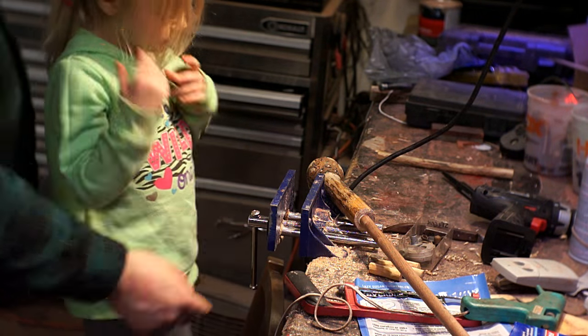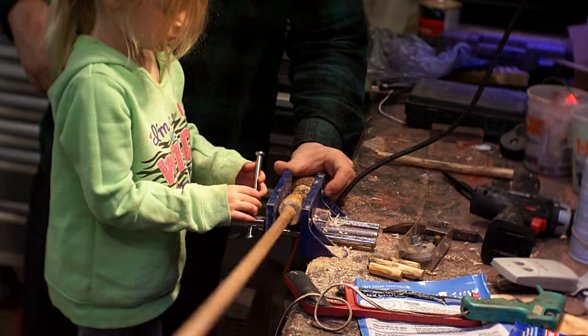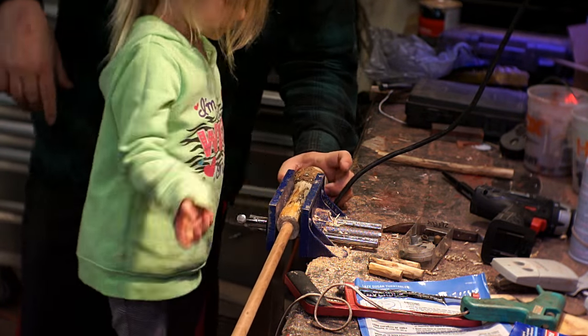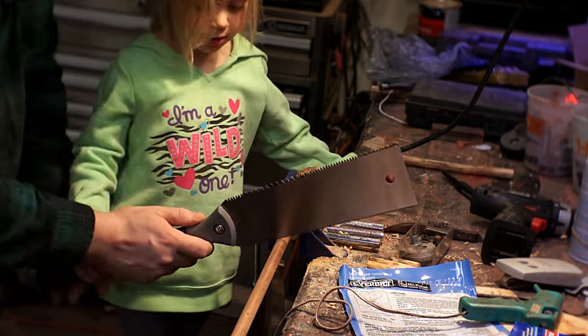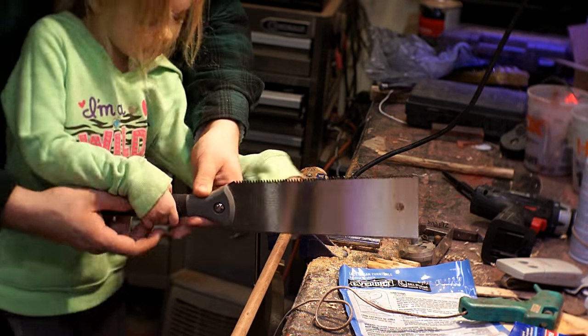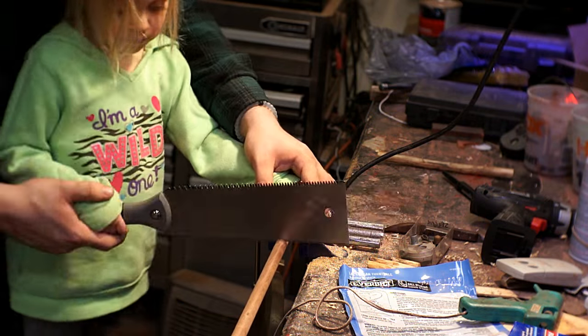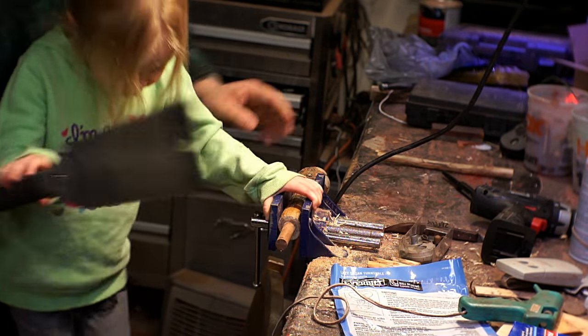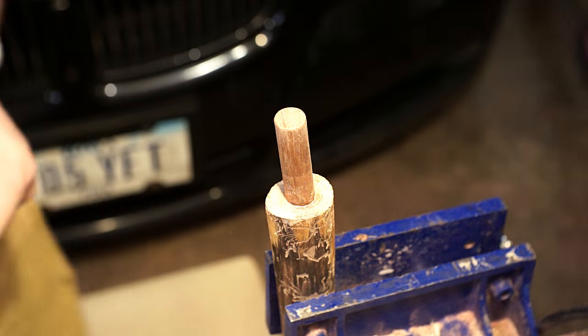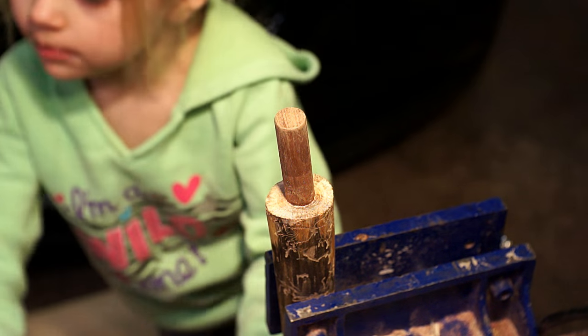After the dowel had dried inside the handle I took it over to the vise. I still really wanted it to look like it was made from a single piece of wood — basically I wanted to fake it. So I put that mallet head up there, saw exactly how much to cut off so it didn't protrude out the top, then took another piece of the wood that did break off, cut it down, and stuck it on as just a cap over the top so you couldn't see any of that business underneath.